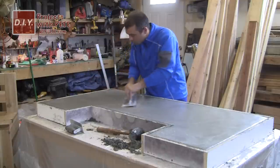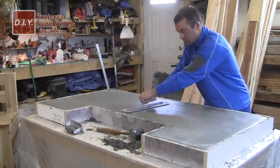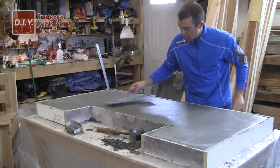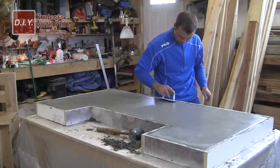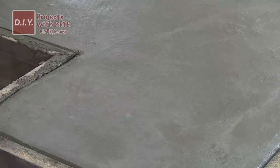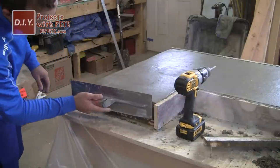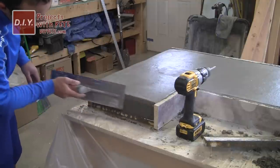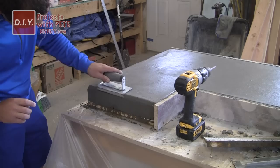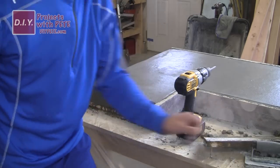You'll need to wait a couple of hours for the concrete to firm up enough to do another round of troweling, and until there's no water on the top surface. The exact time will vary depending on temperature, humidity, and the mix you use. Wait a couple of hours, then do a troweling and run your concrete edger around. Use your finger to test firmness — if it leaves a small dimple, you're ready to remove the sidewalls. Use a drill to slowly remove one sidewall at a time, making sure the concrete doesn't slump. Removing the sidewalls early allows you to get a trowel finish on the sides without filling bug holes later.